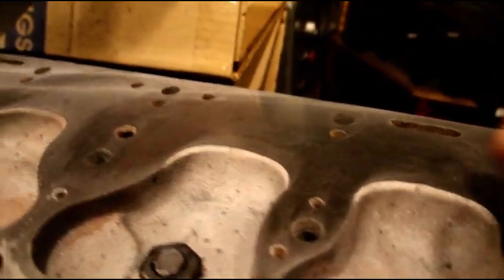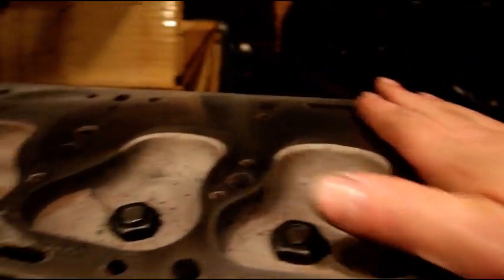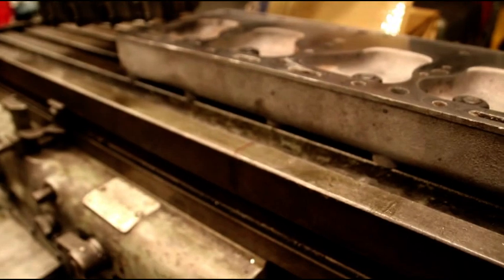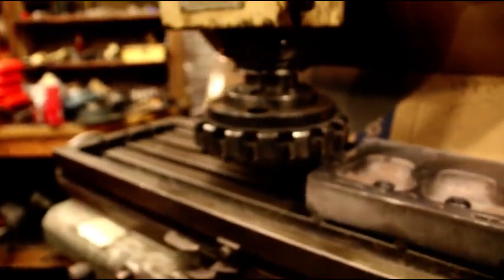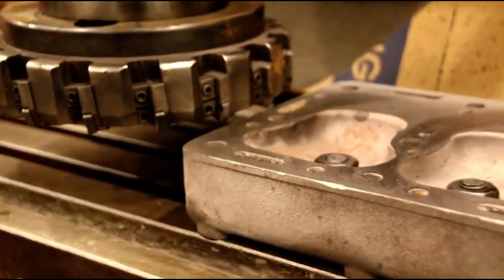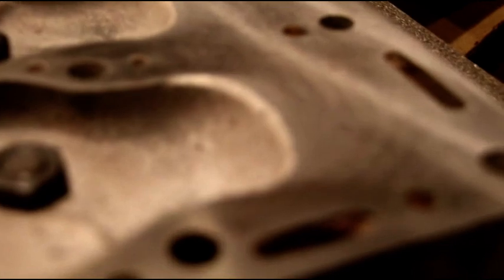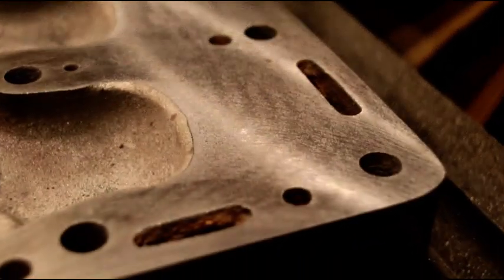That's five-thousandths off the whole entire cylinder head — it's cleaned up completely. You can see me balance a nickel on there. There are guys that try to spin a big face mill on a Bridgeport to do this, but a Bridgeport just doesn't have enough horsepower to spin something like that. You're not going to get a good setup — you'll be underpowered. You need a rigid setup. I knocked the nickel down so you know it's not glued. If you can't balance a nickel on there during your machine work, you're never going to get a good finish. If you're doing this on a Bridgeport, you can make it work with a single fly cutter — a single-point tool.